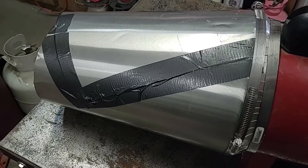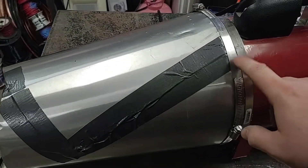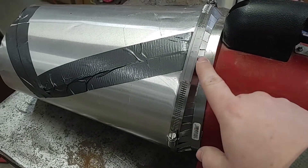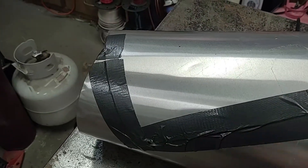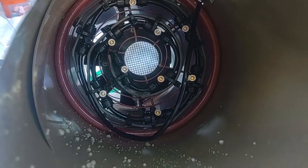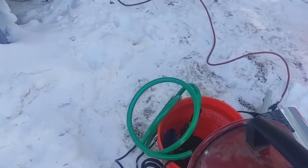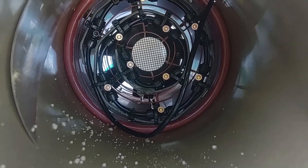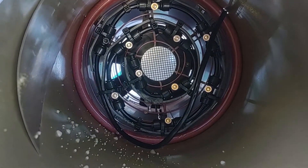Here's how the duct turned out — it goes down from a 9-inch diameter down to 6 inches over a 14-inch length. I used two hose clamps: one around the lip of the fan and one right on the inside. On the inside I put slits in the sheet metal to help fold it around the lip, and then used duct tape to hold the cone shape. I also made one more change and added more misters — originally it had 4, now it's up to 10. Testing this out again today at about 5 degrees out, it's actually freezing the small black water line before it can spray out, because there's not enough water moving through it to keep it unfrozen.